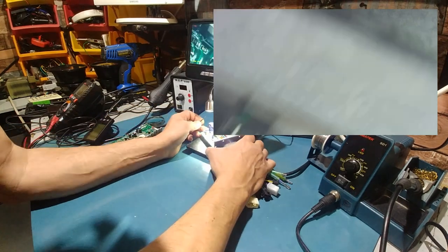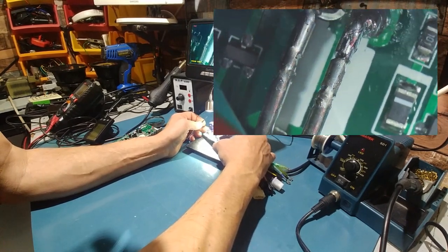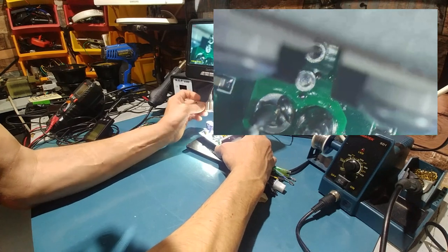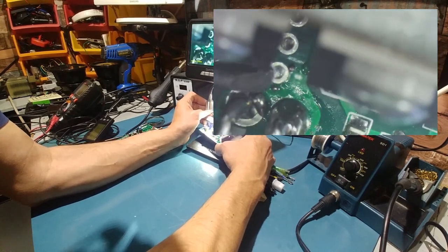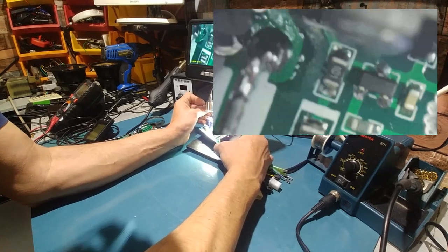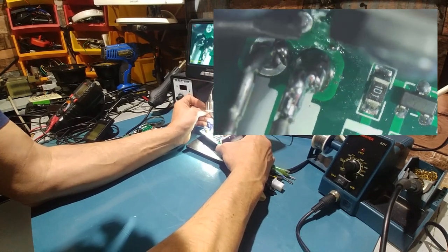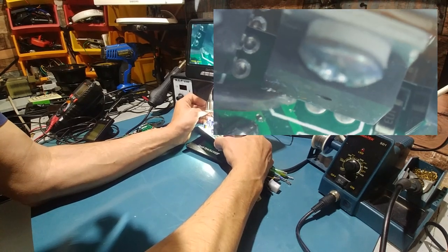This one, on the other hand, not only has it been crimped, you see where they've crimped it with the wire cutters? Which is hilarious. Even I don't do that, but I guess maybe that would work. And big blobs of solder. To make it even worse, down there, there are some loose solder balls sitting on the, yeah, see there, they're loose. All it would take is one of those solder balls to go over here and short one of these components out, and that would kill it. There's another one there, I bet it's loose as well, because it's in flux. Yeah, see there, it's loose as well. There's a big ball of flux right on the chip that's actually dead. It's right there.